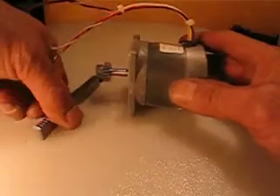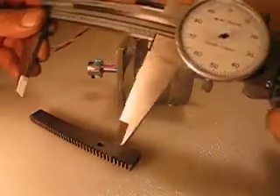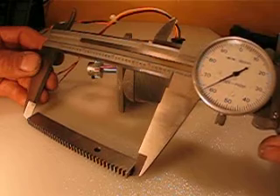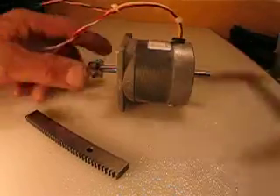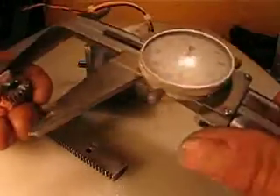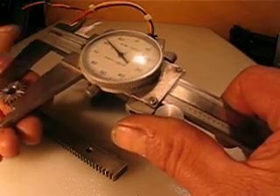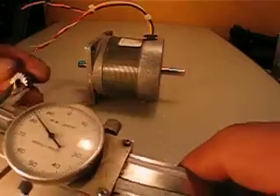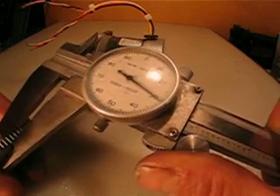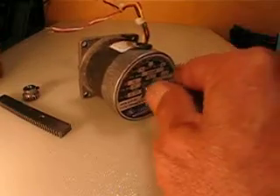This is a nice combination for a Z axis. The length of the rack is about 3.5 inches. The pinion diameter is about 1.4 inches. The thickness of this piece is close to a quarter inch. It has a double shaft so you can actually add to it.